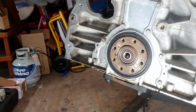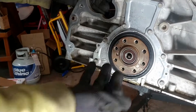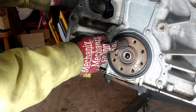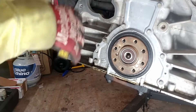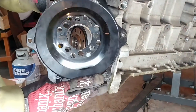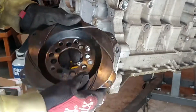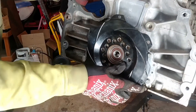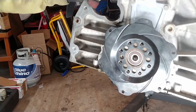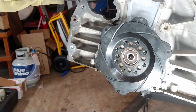You also need to give the machinist the bolt size — mine is M10 by 1. The hole size should be just over 10mm, say 10.5mm, so the bolts go through without hanging up and allow you to clamp down tight to the surface. With that you can effectively machine one of these flywheels. I got this one off eBay cheaply because it's new old stock — brand new, never used. As you can see, it fits right over the crank. Drill it to your bolt pattern and you have a flywheel interface that adapts to a 7.25-inch triple disc clutch.